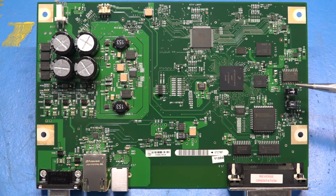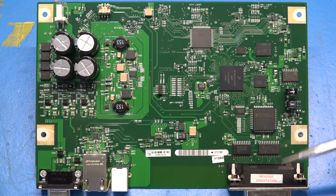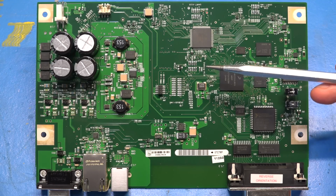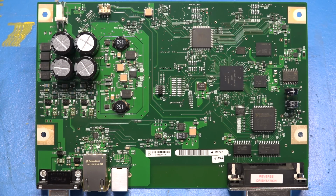I wonder if the front panel has a separate battery for its own little display as well, as the source measure units definitely do. We have an NI part here. This is for GPIB and some associated buffers with it. Nothing unusual. There's an entire Cortex processor here as well. There's a lot of computation thrown into these boards. I guess it's just easy to design them that way. We have Ethernet and USB, and we have a chip particularly for the Ethernet controller. And as you can clearly see over here, we have a bunch of DC-DC converters and some power supply sections over there.